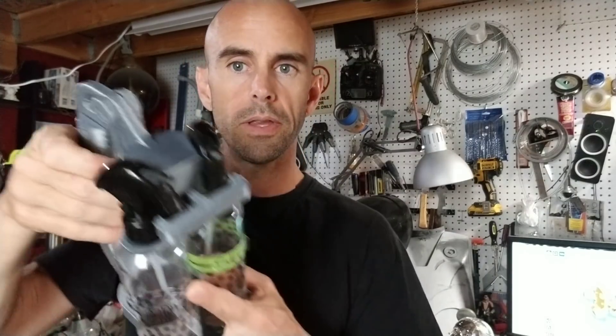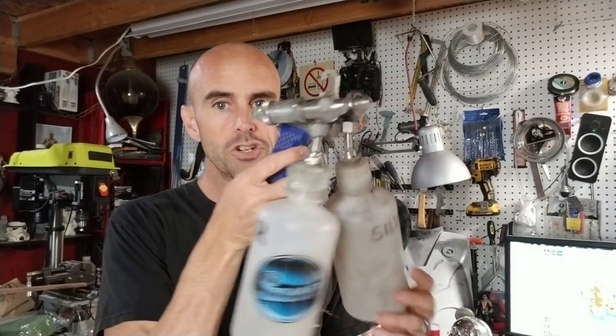I've angled the bottles together a little bit so that the spray combines in the air. When you're working on something small, like a little Terminator skull, this is great because my regular sprayer — the Paasche giant silvering gun — sprays way too much chemical for small stuff like this. So if I'm spraying a C3PO torso or a helmet or legs, that works great. But for something small, like a set of C3PO hands or even an Indiana Jones Idol, the big gun is complete overkill.